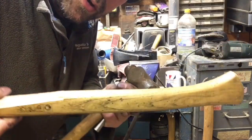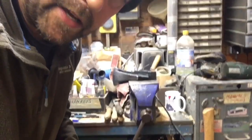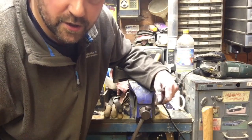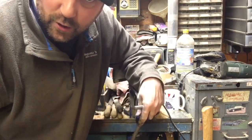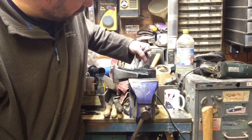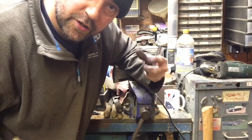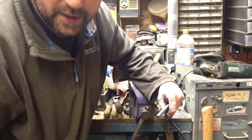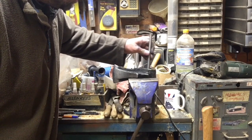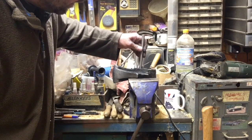You can use parts of your old handle chopped up to act as a drift. However, I'm not going to lie to you — there are big popular channels out there that show tippy-tappy and out it comes. That isn't always the case, especially with something like a splitting maul or a full-size felling axe. When it's got two round metal securing wedges in the top and they're in good condition, they ain't going to come out without a fight. What I find is getting right up in the blade end in the small radius helps to break the initial seal.